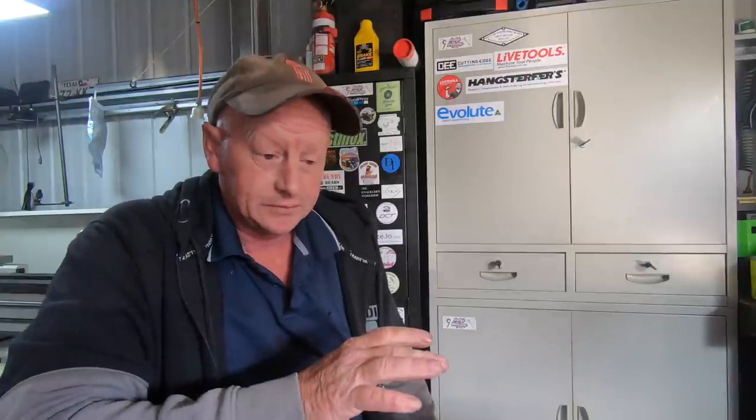It'll have a 1-inch shank, and like I say, there's no plans to this. This is just wing it and hope for the best. It'll hold a 12mm carbide insert tool, and I think it'd be a good thing. So I've got a piece of material, I believe it's 4140, 3-inch in the lathe. I've just faced off, just going to skim the outside to clean it up and start putting a shank on it.